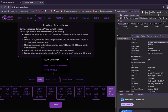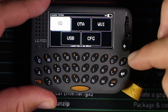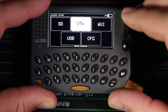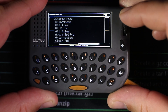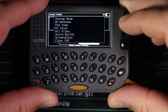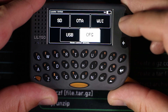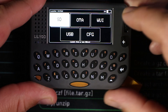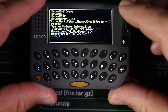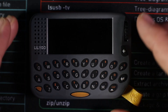Put your SD card into your computer and copy that .bin file onto it. To quickly go through the Launcher firmware: you can use Launcher to boot different bins from the SD card, over the air, via web UI, or via USB. You can change settings within Launcher itself — UI color, brightness, dim timer — and browse all files. To install a different firmware, simply load the .bin onto the SD card, click SD, find the .bin you want to launch, and it will install it on the fly.